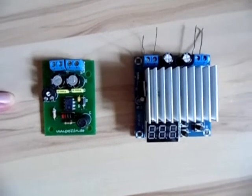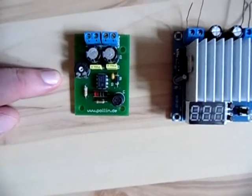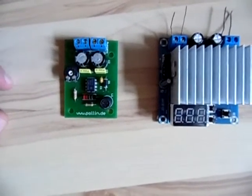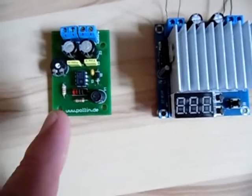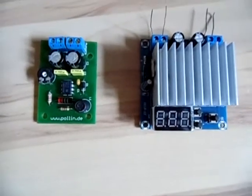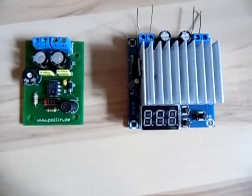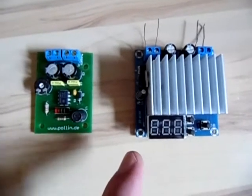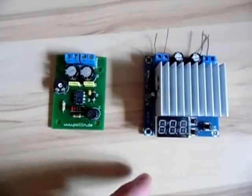Now I have my power supply on the right side, and on the left side you can see a kit sold in Germany — a little bit cheaper, around two to four euros, versus roughly five euros for this one. I want to compare these two because this cheaper one is a switch-mode power supply — you can tell by the coil and the diode — while this one is a linear power supply, as the current test showed. I could connect various loads but I'd rather compare these power supplies and explain why one might be the better choice for you.